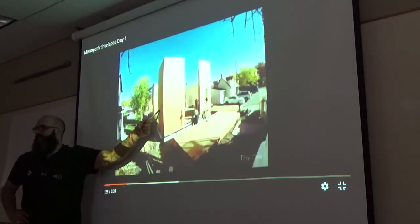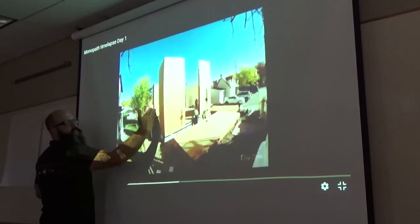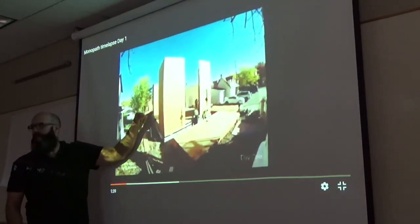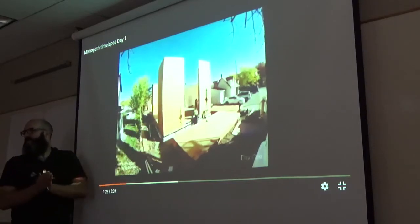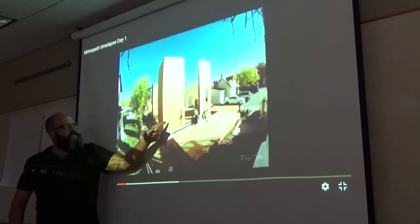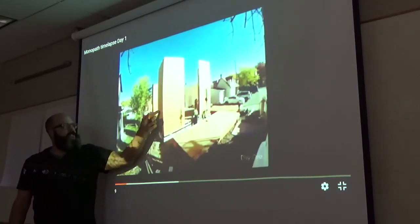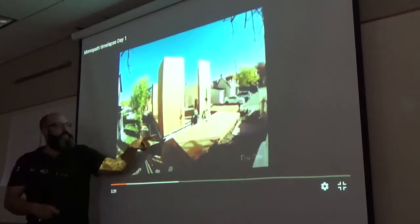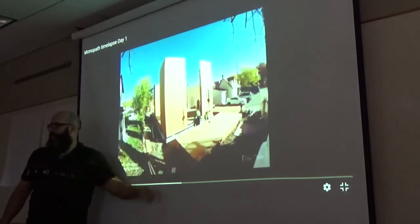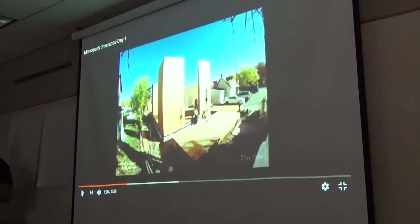Okay, so at this point, you're going to fly in your interior panel, and let's say the panel sits on this wall right here. You've got 8 feet of panel there and 8 feet of panel there where you're going to have lamination contact occurring. So when this panel goes in, you have to already have that glue up. There are 2 ways to do it. One is to stand in here and just glue on the wall, and the other is to snap a line here and here and just lay it out on the floor of the panel. So depending on how many people you have on site, we've done it both ways.